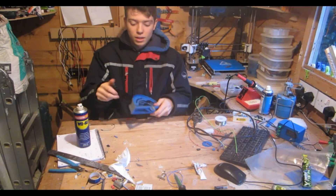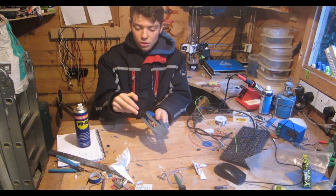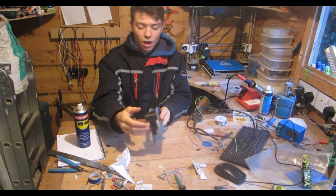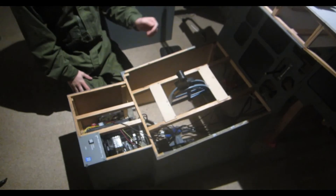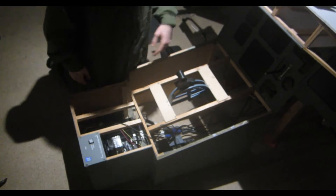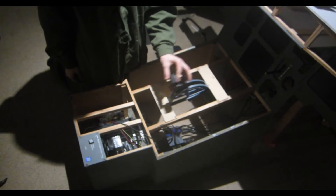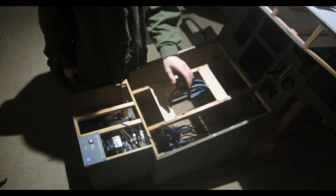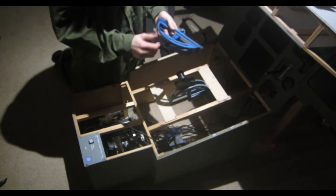This lever is now complete. You pull it up and we have our reverse thrust, push it down and we get click, click, click — our detent. That is working perfectly. Now we need to make another one. Here is the first throttle I made, which is now installed. It has a few issues that have been fixed in the version you've just seen me build — it does essentially work, it's just the latching system isn't ideal. The one I've just built is lovely and smooth.